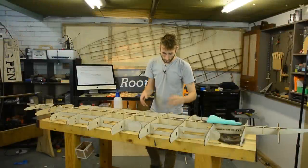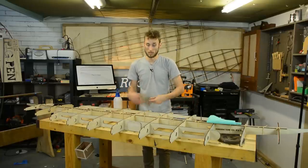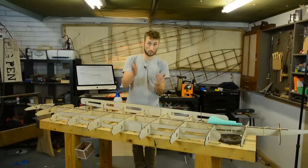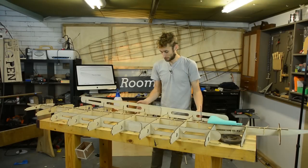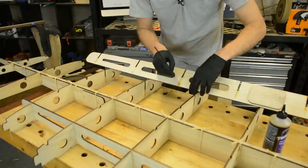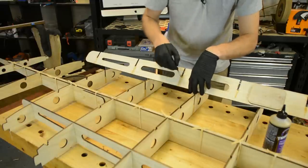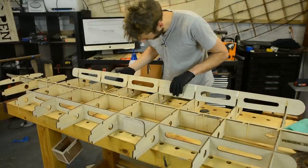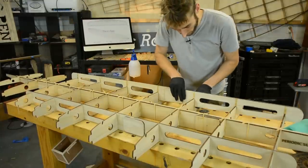Once that has dried for a bit, now is the time to actually glue in the side spine — same process as the dry fit but with glue. You do need to be careful because if we accidentally sideload anything and put stress across the timber, it's quite thin wood and if we snap it that's going to be a delay when it comes to having to repair it. Getting glue on the center can be tricky, so I'm doing it one side at a time and getting it into the slot. As long as there's plenty of glue on the faces and the ribs, we should be fine. Because we had it set dry, everything should go together a little bit easier this time.